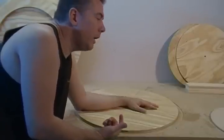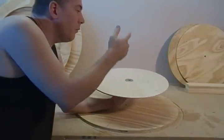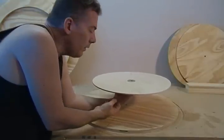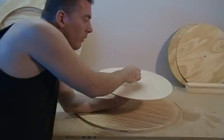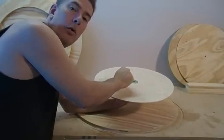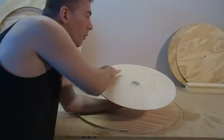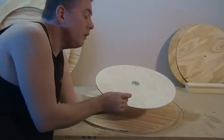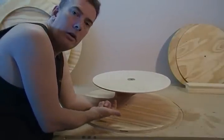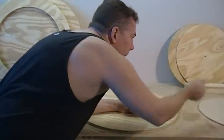Also for access — you're going to have a master blade here on your rotor, and you're going to need to be able to get your screwdriver in from underneath to take that out to get access to the nut on your alternator or fixed magnet motor, however you're mounting that. Without that, all the other rotors are permanently fixed on here. There will be one you can take out. So these holes will give you access to get your screwdriver in there and pull that one master blade out.